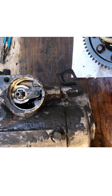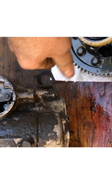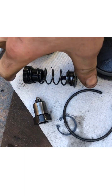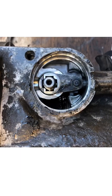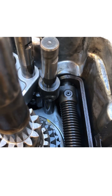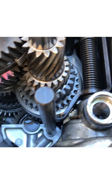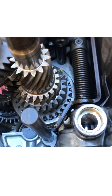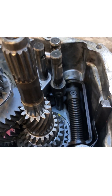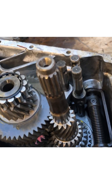That hex head takes a 5mm metric allen key. It is spring-loaded, so you want to be careful. I'll put it back in the neutral position for reference. My plan is that I'm going to punch out that roll pin right there, and hoping that after the roll pin is punched out the shaft just goes straight out. If it doesn't, I'll have to keep figuring out what's holding it.